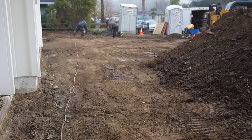This is the problem that sometimes you will have. This gutter is by itself. There's nothing else here. Now, do you run this gutter to that pit, or do you run this gutter into its own pit? Now, if there was a driveway here, I would run it to its own pit. However, since this is our job, with complete, total control of where this thing goes, I'm gonna run this to that pit because it'll be easier.